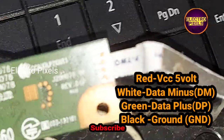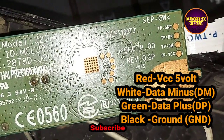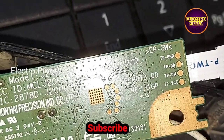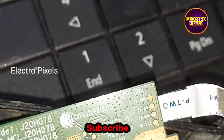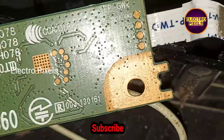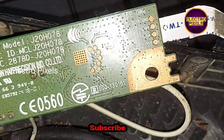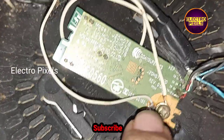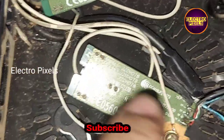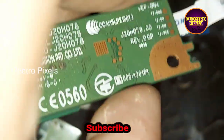Finally, the black wire is for ground. I connected the ground, and I connected the thick white wire as an antenna test point. According to these connections, we connected the old data cable: red wire for VCC 5V DC, white wire for data minus, green wire for data positive, and black wire for ground.